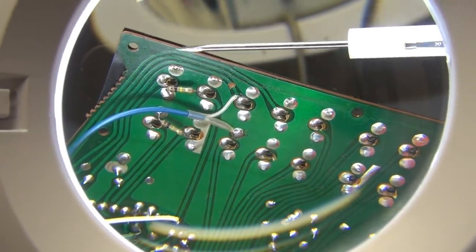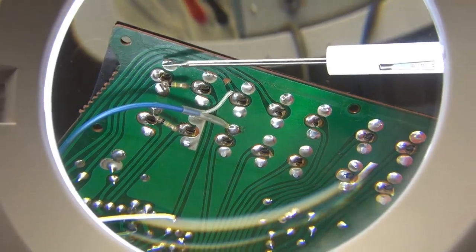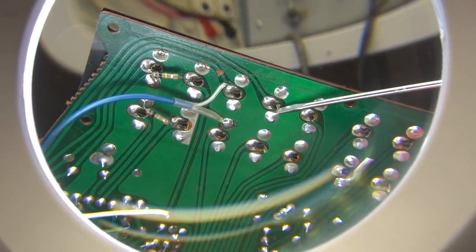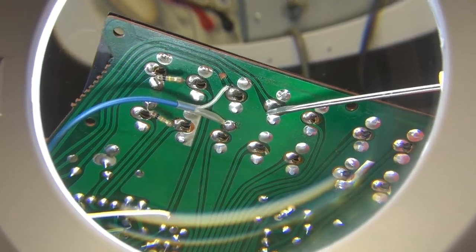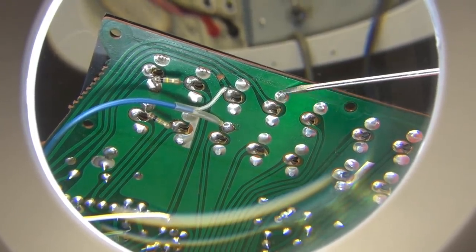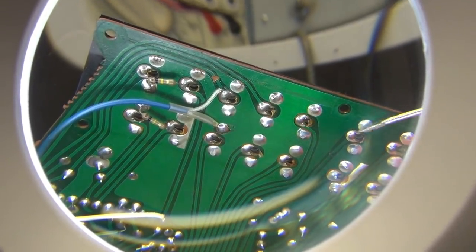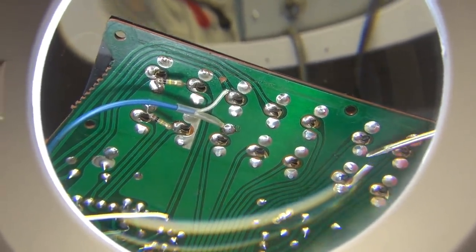So the ones we're having problems with is the fourth position over. So one, two, three, four. Look right there. It's cracked, right around the connection. The ground is also cracked. As a matter of fact, all these jacks have some evidence of cracking on them.